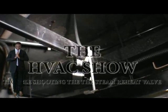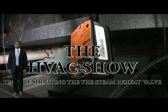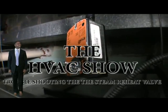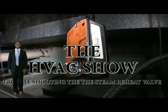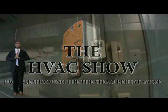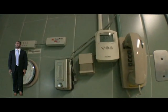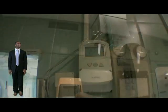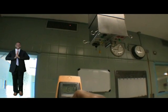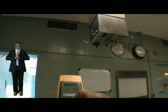Now we're in the ceiling, we're going to take a look at the actual reheat valve. This right here is our problem — this is the actuator that should be on top of the valve. Here's our thermostat for operating room number seven. We'll take a look to check out this supply air temperature coming in and it's still at 60 degrees.